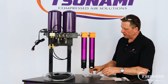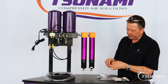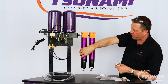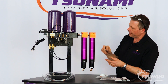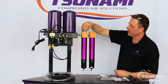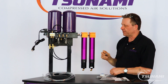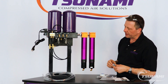Now that I've assembled all of the fittings and the pre-filters are ready to go, before I route the drain tubing, I'm going to take the Tsunami countdown timer that comes with all the filters that require servicing. On this unit, it's our oil coalescing element inside this pre-filter. We're going to use the double-stick tape that's included and affix it directly to the face of the filter or to the top. It counts down, and when it hits zero, it's going to beep and the display is going to flash, telling you you've reached your six months — make sure you service that coalescing element.